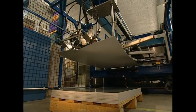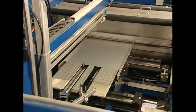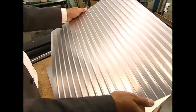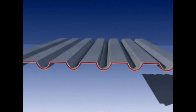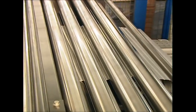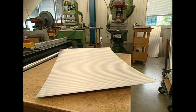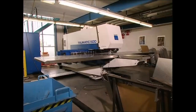The first stage when making a suitcase like this is to give the metal its characteristic corrugation. Each sheet is fed into a roller which bends it into shape. The corrugation serves two useful purposes: the first is to give the case its traditional look, and the second is far more useful — the grooves strengthen each sheet like corrugated iron on a shed roof. By folding the metal through a combination of flats and curves, it can now resist damage, for example when baggage handlers accidentally drop it. Once it's been corrugated, it must be re-flattened, otherwise the next machine wouldn't be able to work with it. To make an individual case, this flat corrugated sheet now needs to be shaped — using an industrial cutter, the sheet is clamped into the machine's grasp, which stamps out the right pieces.